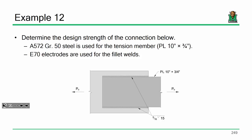The triangle symbol indicates it is, in fact, a fillet weld. Since it's on both sides, there's a fillet triangle at the top. You can also indicate both sides by pointing at both of them — on long plate connections I tend to do that more often. So we want to determine the design strength of the connection. We've got A572 grade 50 steel for this tension member and E70 electrodes, so the electrode strength for these welds is 70 ksi.